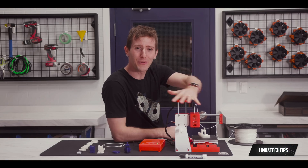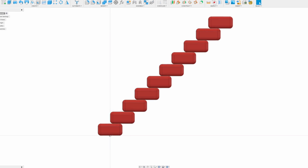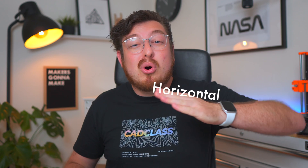Every 3D printer in the world, even those ridiculously cheap ones on AliExpress, can print at a 45 degree overhang. This is because every single layer is supported by half the width of a layer below, which is more than enough material to stick to. The problem comes when you make that angle steeper and steeper, to the point where the next layer hardly has any material at all to be printed on and just droops onto the build plate. In most slicer defaults, this overhang angle is set to 45 degrees — anything more horizontal than that is going to need support material.